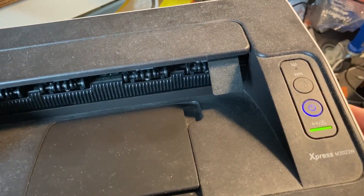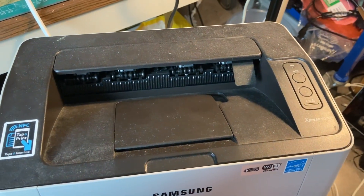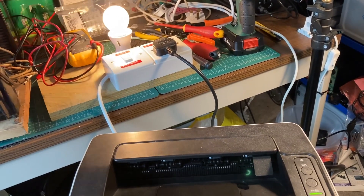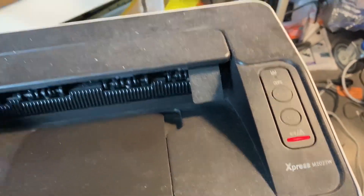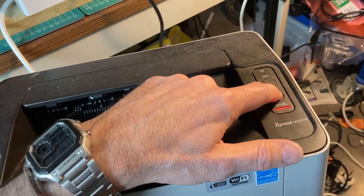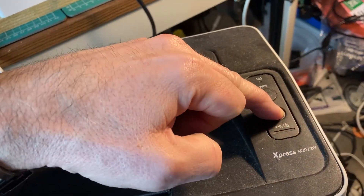If I bypass the bulb and switch it on — there you go — the relay is clicking, the printer is now starting up. And if I switch back to the limiter, it's trying to draw current, drawing a trickle, insufficient, and now it's got a red warning or something. In terms of throttling current, the bulb limiter is working for a device which would try to consume a much higher current. Let's switch it off at the socket — we've got the lamp in series. Let's power cycle that so there's nothing left.